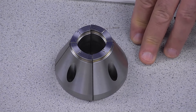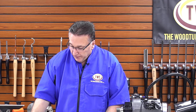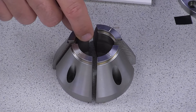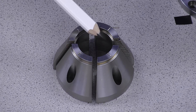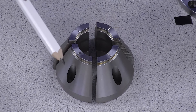And lastly, we have the O'Donnell jaws, which are probably the most popular jaw for the SK-100. In the SK-100, it's available as a three-in-one set, which is very popular. Here, for the SK-88, it's available to grip down on a 35mm cylinder or 37mm dovetail, or expand into a 50mm recess. These are great for various uses and really allow you to get your piece away from the headstock, giving you tool access from both sides.